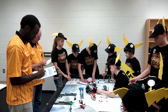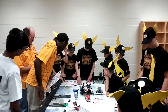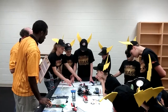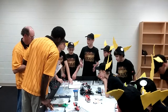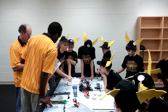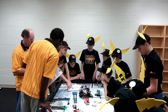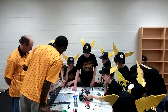And what it does is that it goes here, and the gyroscope senses it, and if it's at 0, it just keeps going forward. If it's not at 0, it resets it and does this. And depending on whether it's positive or negative, it will turn right or left more, because positive is right and negative is left with the gyroscope. This is a loop right here, so this will run over and over again during that mission. This is a switch, so if the answer is yes, and it did turn a little bit, it'll go with the yes. If it didn't turn, it'll go up here. If it did turn, it'll go here, which is another switch.